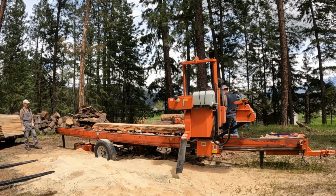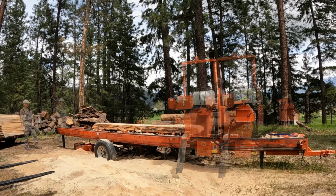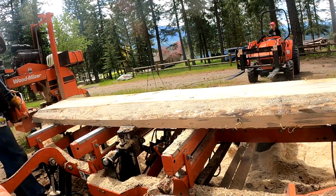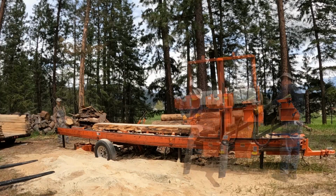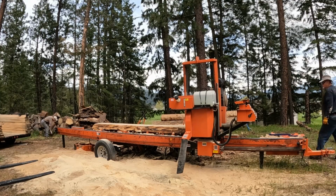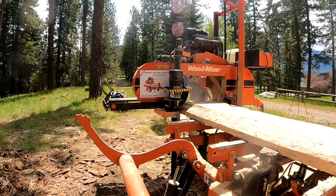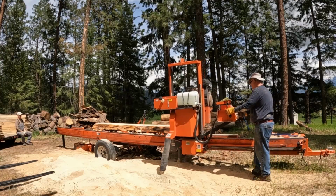But I did notice when I first ran the head in that it was just a slight angle right there, and I thought, okay, I'm gonna go ahead and knock that off, that one corner that's gonna hang me up. And again, you're talking a corner there that was probably right at 28.5 inches. And so I had to just knock that off enough and get her down to around 27.5. Then I can slip the head by. And it's just a game of trying to get every last quarter inch of width you could possibly get out of a log.